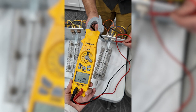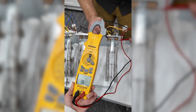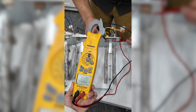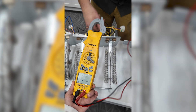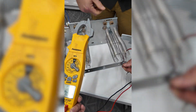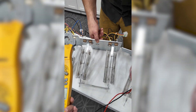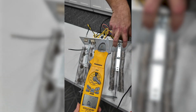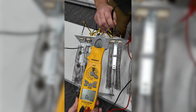Our different heat kits give us different resistance measurements, which determines their amp draw and how much heat they put off. This 5K is giving me 11.4 ohms. On our 8K, we have a little bit more, and the 8K is actually the combination of two different coils. Our 10K is similarly the combination of two coils running together that give us our actual 10K output.